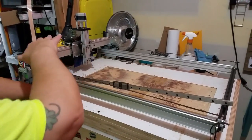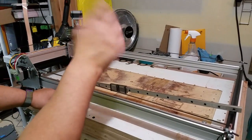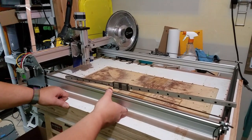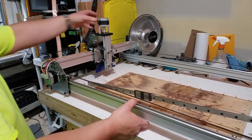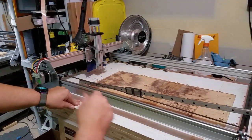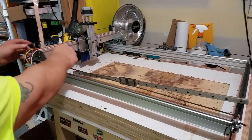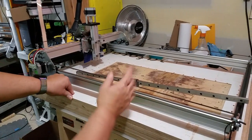Since I'm putting these linear slides on, it's gonna be very rigid and I won't have to worry about the wheels. I looked at doing a slightly different system but it would've ended up basically the same size — just smaller extrusion. This machine uses double extrusion — two makerslides per side — but the wheels just don't perform well, especially on the Z. The slides are gonna bolt right onto the sides and the Y-axis gantry will be done.